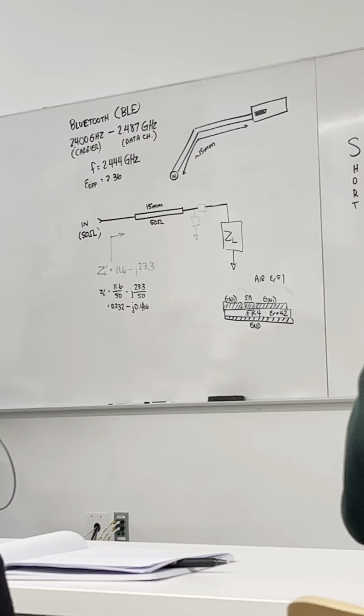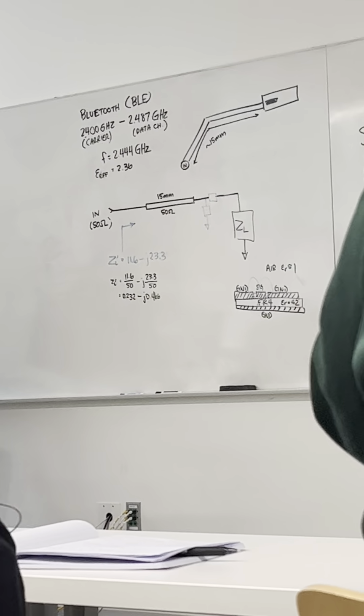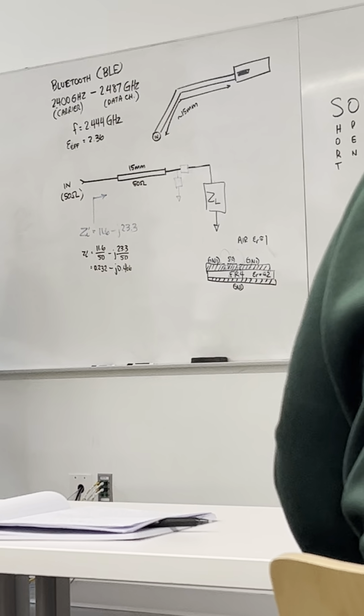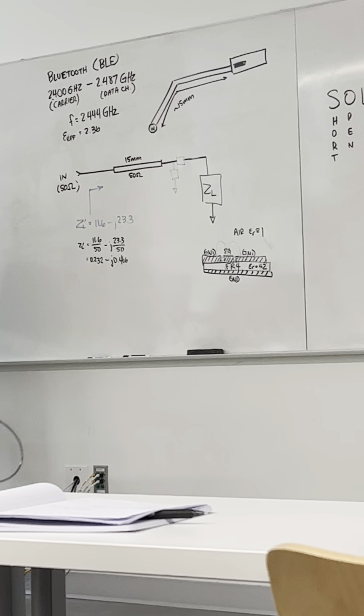Whatever material it is, more than likely that's FR4 because it's cheap. If in doubt, it's probably FR4. The only time you would go, ooh, what's this, is if you look at Rogers. FR4 is kind of that beigey, yellowish color. Rogers is white, and if you scrape it, it kind of powders away. It's a different material.